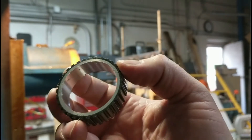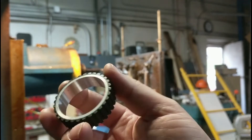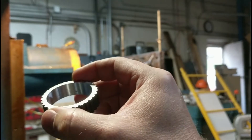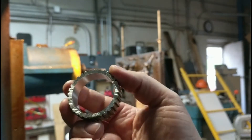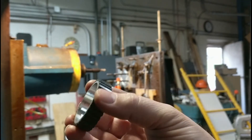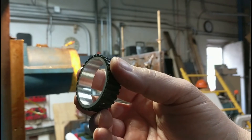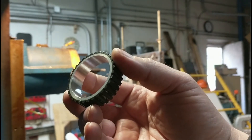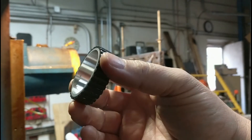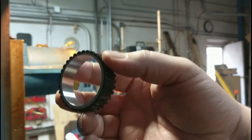The cutting oil I had was way too thick, but it still turned out pretty darn nice. It took me three tries to get the right diameter — it was like three thou under on the last cut. I still have to make it the right thickness; you can see it was just cut off. Love the Kearney and Trecker, I have to tell you — look at that finish, and that's not even trying. It does as good boring with a mill as it does boring with a boring bar. There's no backlash. It's just amazing.